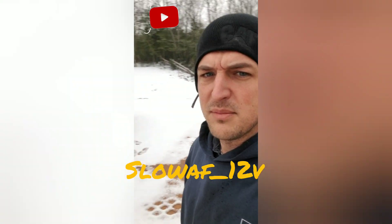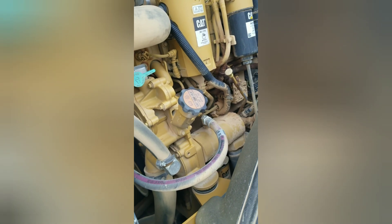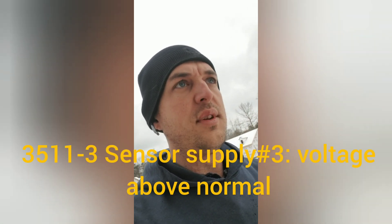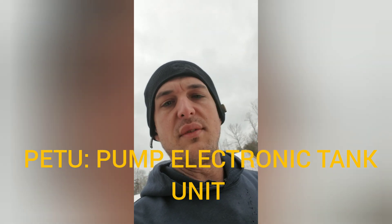Welcome back to the channel — welcome to the job site. We've got a C4.4 throwing a 3511-3 fault. On any of the C4s or C4.4 industrial engines, this fault basically references the DEF pump — the PETU — as a loss of the 5-volt reference. Any time you get a dash-3 or dash-4, that's an open or short referencing the internal 5-volt reference inside the module. It's non-serviceable — pretty much means you just bought a pump.